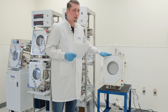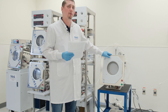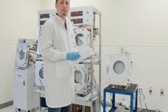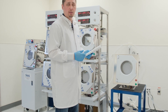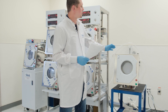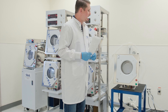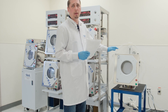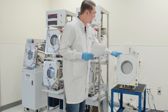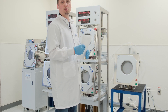A lot of the SRDs that are sent in, especially when they send in ahead, is for a full refurbishment. When an SRD is sent in for a refurbishment here, every SRD goes through the same extensive refurbishment process. First, we break the whole SRD down to the component level. Then we inspect each component for function, and then we chemically clean and electropolish all metal parts. After all components are verified for function, we will move into the dry testing.